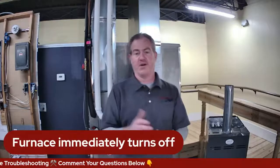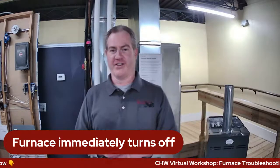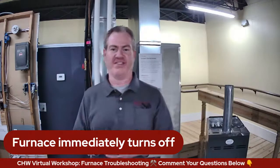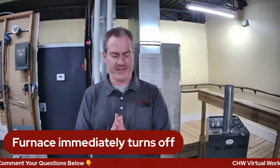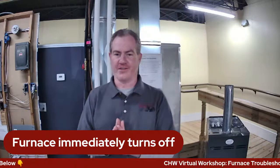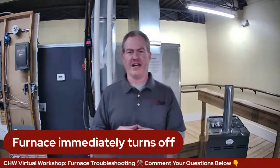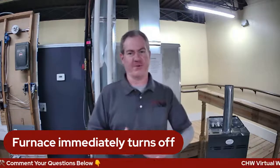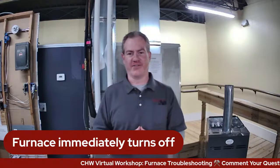So what if your furnace turns off after it starts? The first thing is the vents I just talked about — that's honestly the most common reason we see for a furnace shutting off right after it gets started. Another big thing is your furnace filter. This is really important. If your filter is very dirty, it makes your furnace work hard, and sometimes it'll even overheat to the point where it just shuts down — it'll run for a few minutes, you have heat, and then boom, it just shuts off again. Make sure to check your filter.